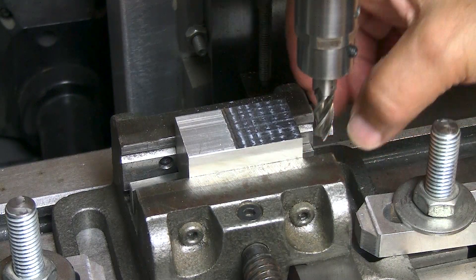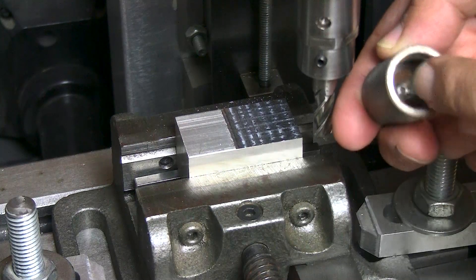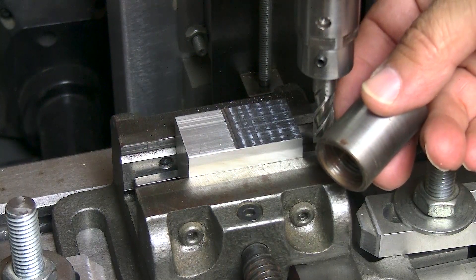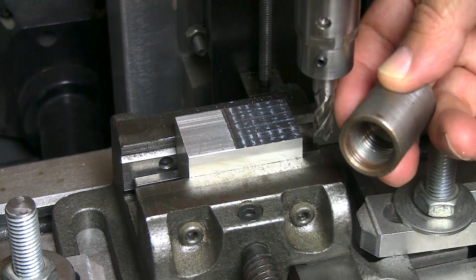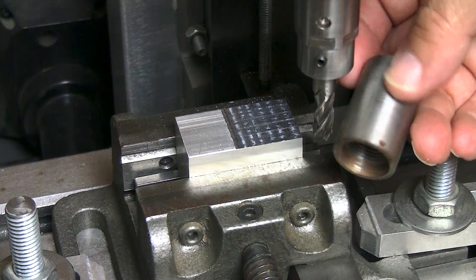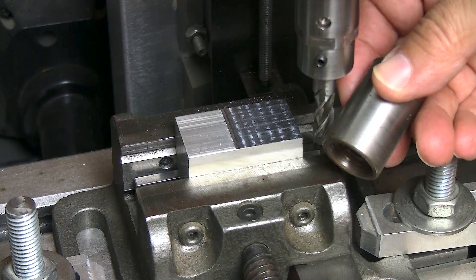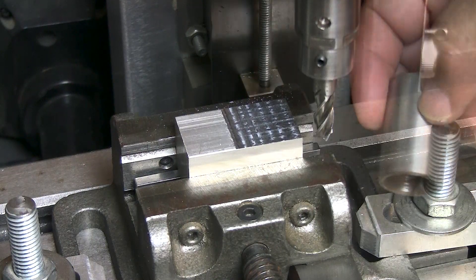In the middle of a project I might need to create a special arbor, so I use these little blanks — they come pre-threaded and you just drill them out to whatever diameter you need. On the Teg you can attach this directly to the spindle with no chuck needed, then machine them in place. This ensures super accurate concentricity because it's screwed to the spindle. There's a tapered step that seats against a matching taper on the spindle, giving very accurate seating. You buy them for three or four dollars — Teg is still in business and you can get these for many other purposes beyond a home shop-made milling machine.